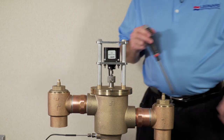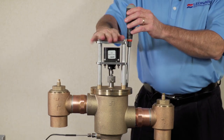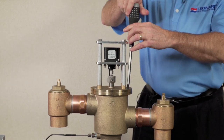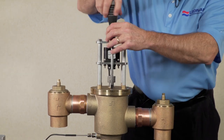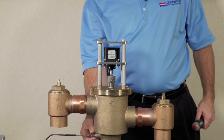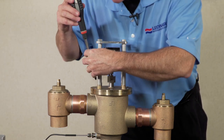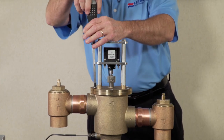Now take the number three Phillips — remember the six-inch shaft length — so you can get up beyond the guarding assembly and remove the six cover screws. Loosen them all first. If you find any extra resistance on the screws, check again that your pressure is relieved on the compression fitting on the left side of the valve. Make sure there's no stored energy in the device and that all pressure is drained off before removing these cover screws.